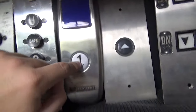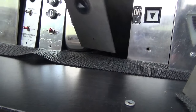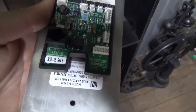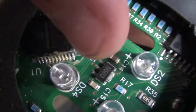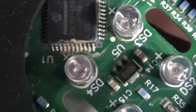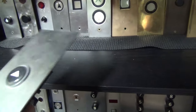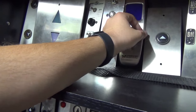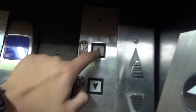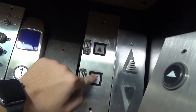That is some generic button — not sure where he got that from. Habitat store. That again is a proximity switch from Isis. So pretty much you've got this huge circuit board — which is why it's so hard to wire up. You just have this little magnet, and that little black square in the middle is your sensor, with four LEDs around it. You push it in and it just detects it. I'm slowly figuring out what each pin does. The funny thing about that panel is it did light up, but then we threw it on a piece of metal on accident and it shorted out — so we're going to have to repair that one.